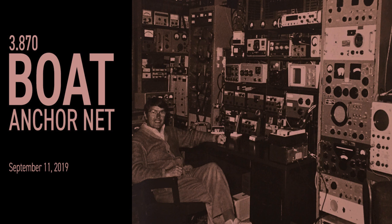No, but I got a question about a TS-820S, if somebody comes on that can answer it. Well, why don't you pose the question? If anybody has a comment, they can come up. Okay. It has zero power out on sideband, even when you modulate it. And it'll just be about 10 watts on CW. And that's all it does. Anybody have any comment for Andy?